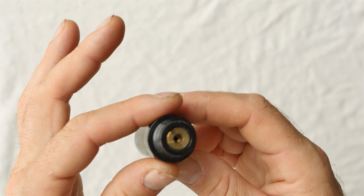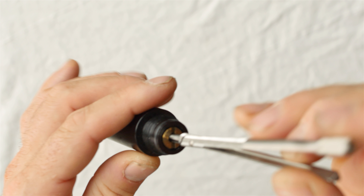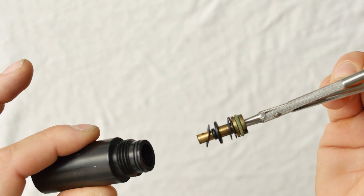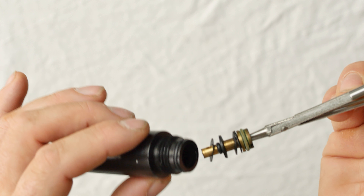This has the typical brass piston Belleville regulator design. As we pull the regulator assembly out, we can see the Belleville washers and the stainless piston down further — exactly identical to what Eric Scott and David Kermode used.